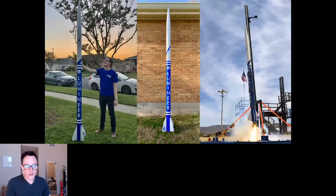So: how not to get your level three. This is Lumineer — a 98 millimeter minimum diameter rocket designed to go to 30,000 feet. That is maybe rule number one about how not to get your level three. That is a wildly ambitious project for someone like myself who has flown like two high power rockets. I bit off a lot more than I could chew with this. It's actually a miracle that it worked as well as it did, even given that it didn't succeed fully. It's a fiberglass airframe — a 60 inch section and a 30 inch section from Mad Cow with a 5.5-to-1 Von Karman nose cone and custom fins. You can also see a flyaway rail guide.